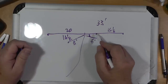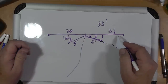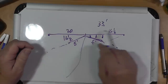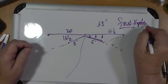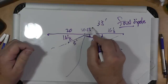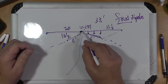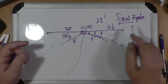You can either put a bracket and kind of hang the 6-meter dipole down under the other, or you can just pull it away and have a separate rope taking it down to the ground. You've got what's called a fan dipole. A fan dipole is a dipole with multiple band elements all connected to the same connector. You'd put an SO-239 in place, run the wires off of it, solder the inner conductor to the two elements and the outer braid to the other two. Put an insulator in the middle for mechanical strength. This will give you a fan dipole.